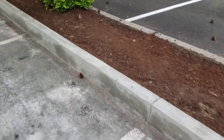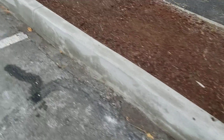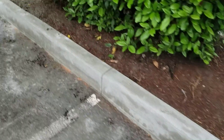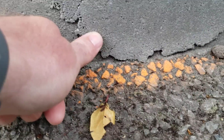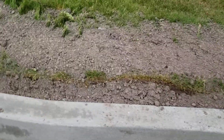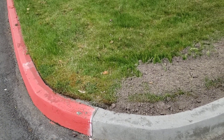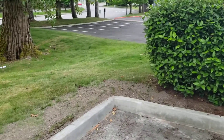This section looks real nice as far as consistency. The curb breaks are a lot tighter on this one. Looks like we added some material here — if we kicked it, it would come right off. You can't super see it from back, but make sure when we're adding material that we're either getting to it quicker so it molds in, or pressing it in nice with our trowel. Breaks at all the starts are good — usually we put a couple of breaks in the corner.